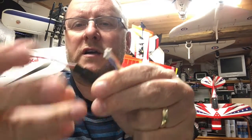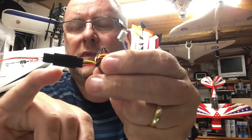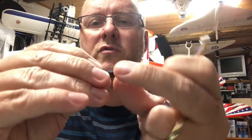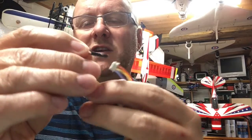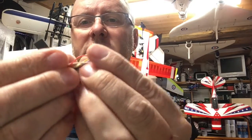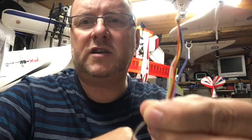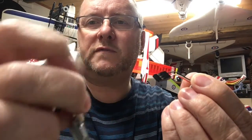So I like to make my own plugs. You can do two things: if you haven't got the ability to make them up, there is another way around. What you can do is take a servo plug — be careful because the red is on the outside edge. Red is on the outside edge, so you need to pull these pins and wires out to match that wiring convention, otherwise you're going to get yourself in trouble. What you can do is cut the plug off and solder that onto there, so that you end up with a lead that plugs into your camera and this plugs into the switcher — the VTX, the video transmitter.